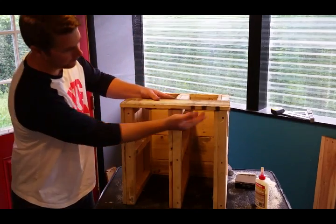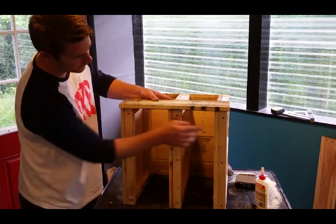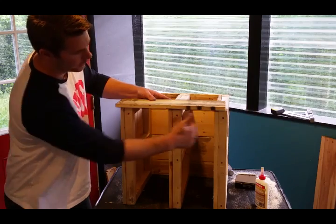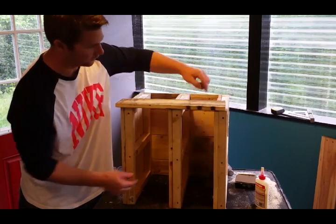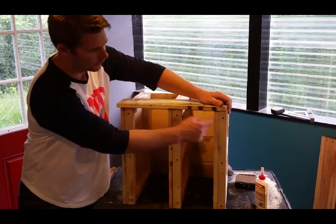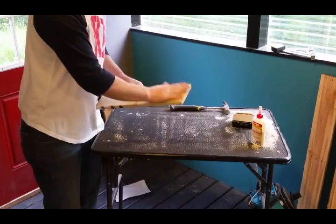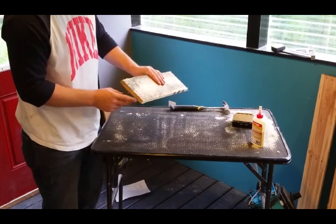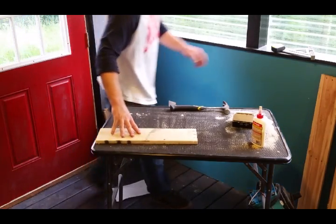So we're going to have a half inch of this overhanging beyond, because I want to see this end and not those. And we also have to remember to mark this measurement here, which is going to be 6 inches from this point here up. So we're gonna go ahead and get started with that now. So the first mark, this is gonna be our top side again because it's got the nails in it. And it's the straightest side that we have. So that's gonna be the quarter inch line we're gonna have to mark again.